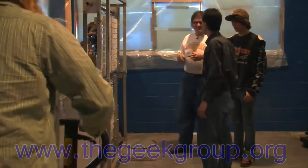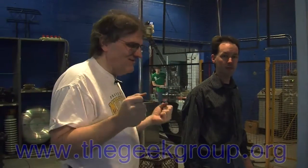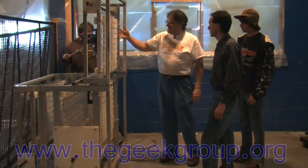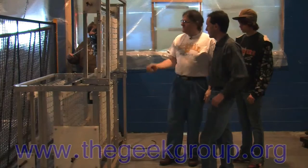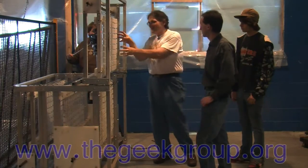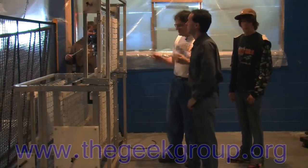Usually MMC cap arrays — multiple miniature capacitor arrays — are kind of hard to work on because they're all compact and you can't get to them. We wanted something that if you needed to replace something, you could open it up and get to it in a big hurry. You can flip the side up. You've got 10 caps here, 10 caps here. They're in series, so that's one string of 20 caps. If you blow a cap out, you can undo the little binding and pull the whole string of 10 out and stuff another one right in. We have backup strings laying around just for such a purpose.